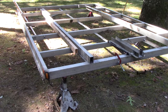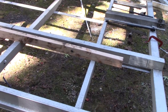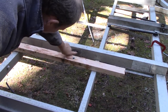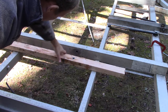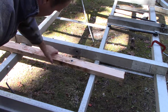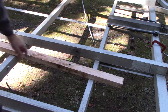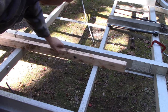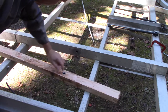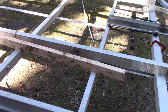With the wood insert, when I clamp the tongue down there'll be no crush effect. Those pivot holes were wowed out bigger than five-eighths in some spots. The tongue itself is still okay - still half-inch - but the tube section here is five-eighths and bigger in spots. So what I did is drill a bushing into this wood insert. Now between the wood and the steel bushing, when this is inside the tube there's no chance of it wowing out anymore - the bolt will go through a steel bushing insert.